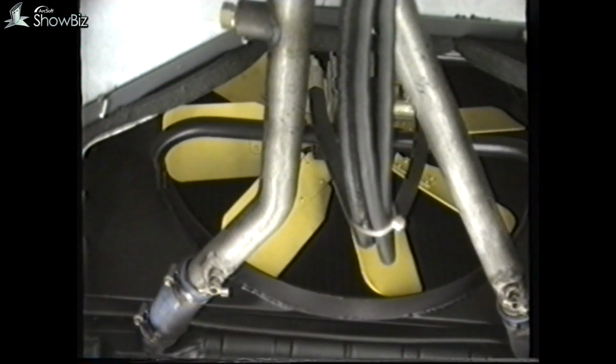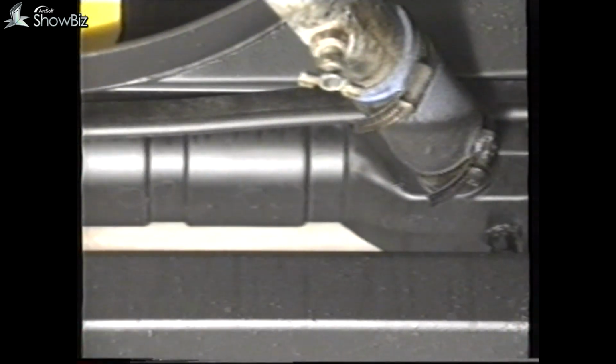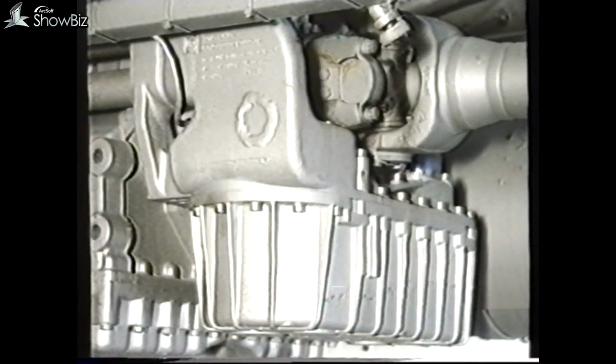Here is an example of this, where the pitting has penetrated the wall completely and allowed water into the cylinder. As an alternative, if the mixture strength is over-concentrated, it will attack aluminium components and solder, which are present in radiators and heat exchangers.